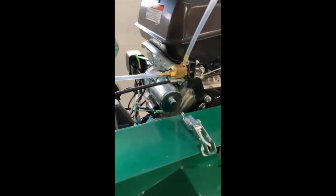Okay, back again. We have the battery box in, the battery cables are on. Hopefully you can see that. I do know that people struggle with that battery cable. It took me maybe 10 minutes to put both of them on. But keep in mind when you're working with metrics, anytime you see a smaller bolt, it's probably a 10 millimeter. So if you've got a 10 millimeter socket to get on that nut, and here's that spade connector that I turned around. It's red, but the wire is blue. That used to face the other way with the wire going out the other side, which makes it really tricky to get that on there.